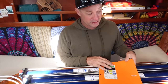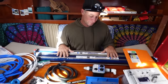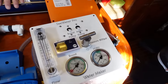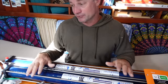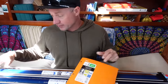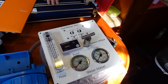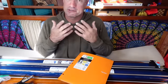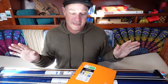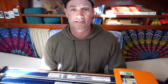In a nutshell, water comes in through our filters — minus the pump I don't have yet that supplies the water flow. It then makes its way through the membranes to our motherboard and spits out fresh water. It is really that simple. We've got a fresh water flush, which is a manual one. There's no fancy components — very simple unit. I love it. I previously had the Rain Man and I did like that, but there are a few key things I like better about this. The membranes themselves are designed a lot better, and I love the concept of just switching boost pump and main pump and it's making water once you've preset the optimum pressure. Come time to turn it off, it's just a matter of pushing those two switches down, and the automatic timer takes care of the automatic flush.